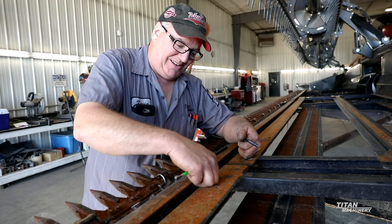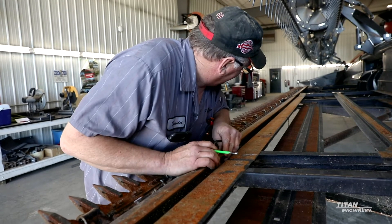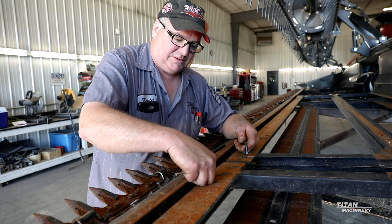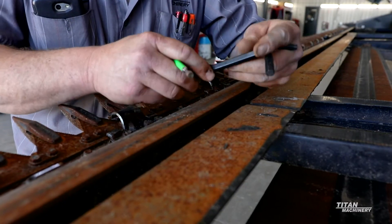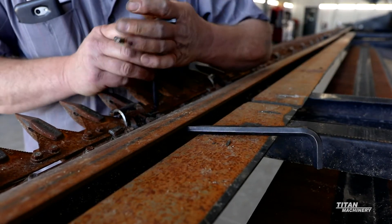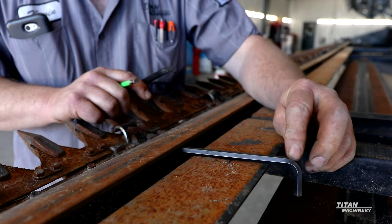Also on this C channel and your deck plate, as you can see in here, there's an adjustment and there's about five or six of them along the whole deck plate. You'll want to make sure you adjust these. If you get a brand new canvas, these might have been adjusted up from the used one. The three-eighths allen wrench is what we use as a guide - they should lay flat down and that would be about right. For older ones, a good rule of thumb is using a five-sixteenths allen wrench and you can see it should lay just about flat.